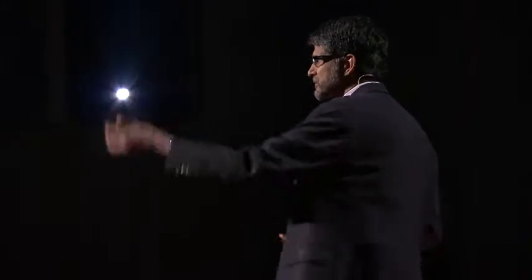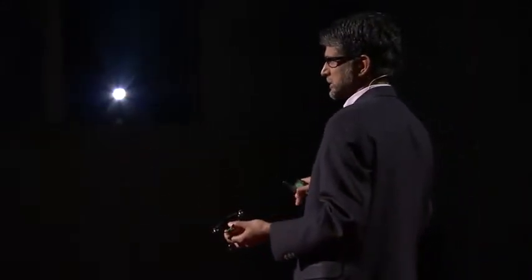So to remind you of physics, you have position, derivative, velocity, then acceleration, and then comes jerk, and then comes snap. So this robot minimizes snap. So what that effectively does is produces a smooth and graceful motion. And it does that avoiding obstacles. So these minimum snap trajectories in this flat space are then transformed back into this complicated 12-dimensional space, which the robot must do for control and then execution.